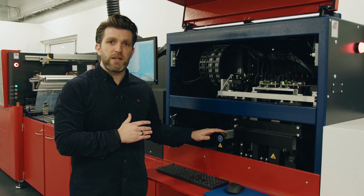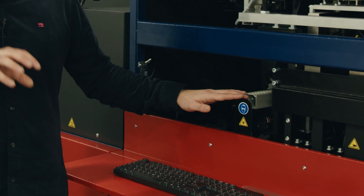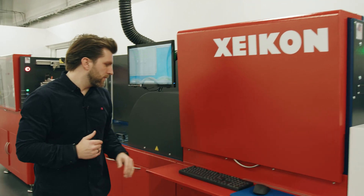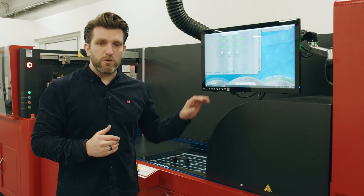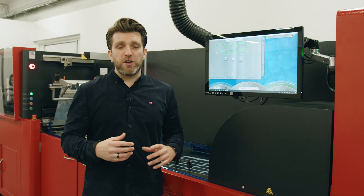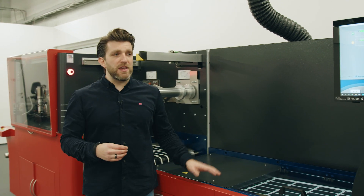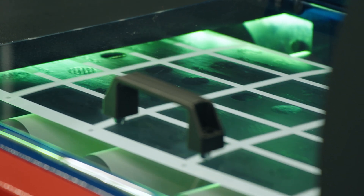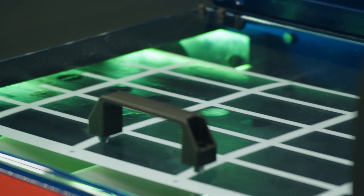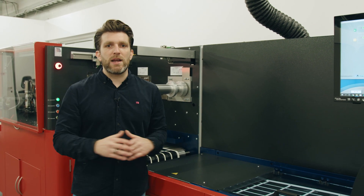After inkjet printing, we need curing. The first step is LED pinning, which pins the actual printed varnish before moving further into the machine. The second step is the infrared chamber, needed when you want a flat surface of varnish — it helps the varnish flood to avoid pinholes or an uneven layer. The third technology is UV curing, same as the flexo station, but here we have a water-chilled roller, enabling use of sensitive materials such as PE or pouch material, keeping that wide range of substrates.